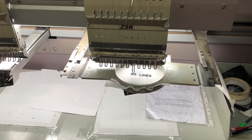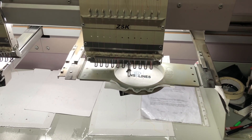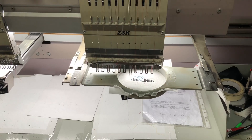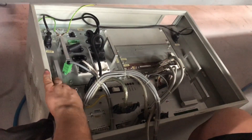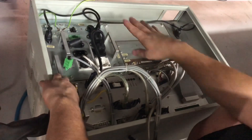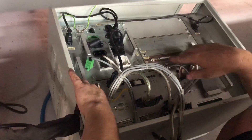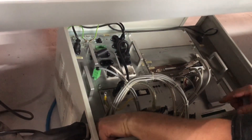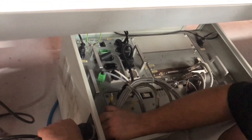No problem at all. Going through the trim. I call that a big success. Thank you Nathan — we've done well again. So the logic was that we had power coming to the machine for the lights, which is this distribution panel. We had power coming to the computer. The fault we had was stopping the drives of the main motor, but not of the X and Y. The other power supply just wouldn't power up at all, and it was blowing fuses.